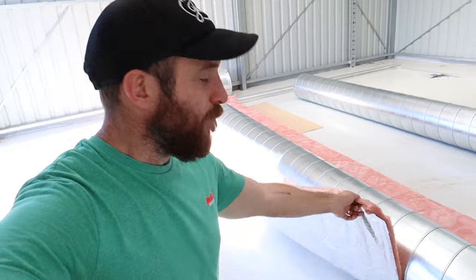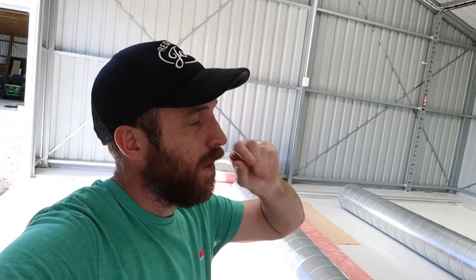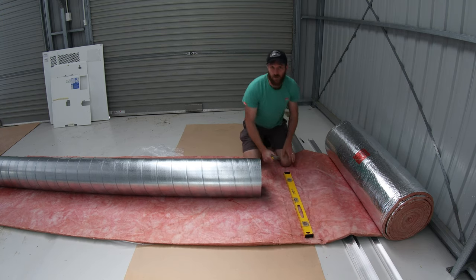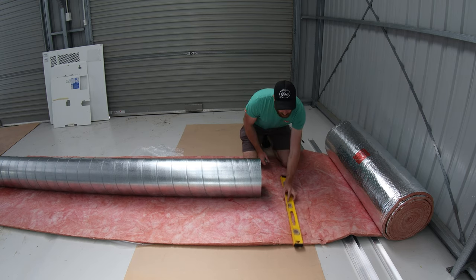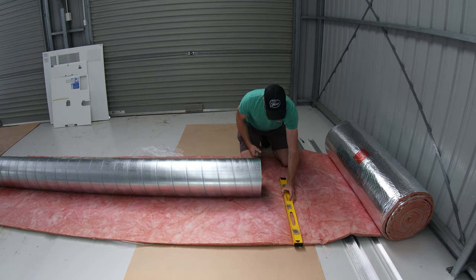What we're doing now is we're going to insulate them. We've got some insulation wrap here. We insulate them and then we've got to get up on the top of the roof and put the fasteners in place where they'll fasten to, and then with our scaffolding there we will get this big pipe laid along the roof. Once it's up we can pretty much leave it there, build the fruiting rooms below it, and then once the fruiting rooms are up we'll put all the fittings on the end and connect it up. So quite simple really. We've got our insulation wrap here — it's a foil-backed wrap, about R1 — it should be enough to insulate that heat or cool air moving through here. We're going to cut it, wrap it while it's on the ground, and lift it up. We're not going to try and wrap it after we hang it — that would probably be a disaster.